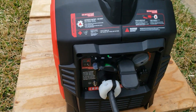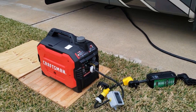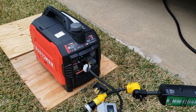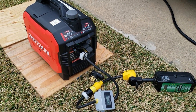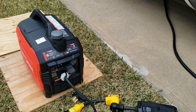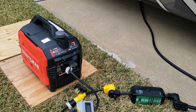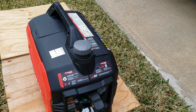We just tested the Craftsman 3300 — wow, I like the way it delivers the power. Didn't see any problem at all with the eco switch being off. If you guys are having a problem with that eco switch being off, you're using the wrong generator for the wrong job — get a bigger generator. This one is meant to do exactly what I load tested it for. 3300 watts starting, 2500 running — I think it works perfect without the eco mode.